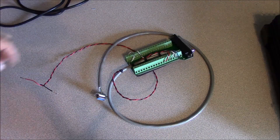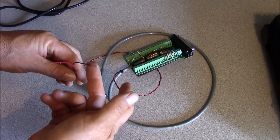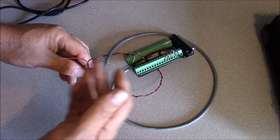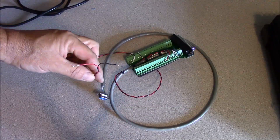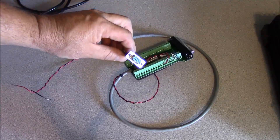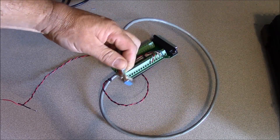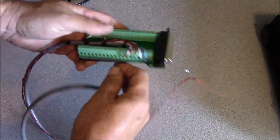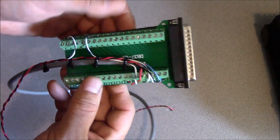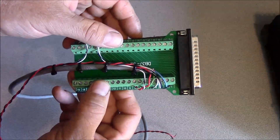Here's our homemade programming cable. You have this lead here which you basically hook to your power supply — I tin these wires so I can use test clips to provide power to the control board of the radio to facilitate programming. We have our DB9 here, which goes to the PC, and our DB37 that plugs into the back of the radio with our jumpers and connections to the DB9 to the computer.